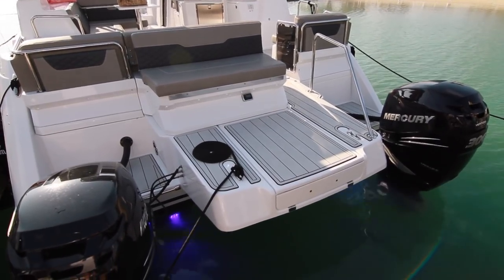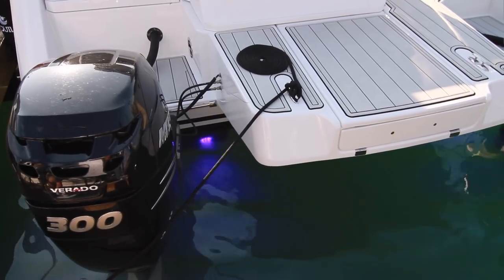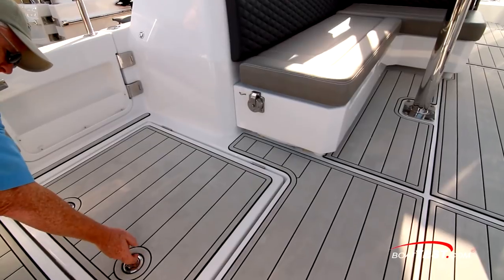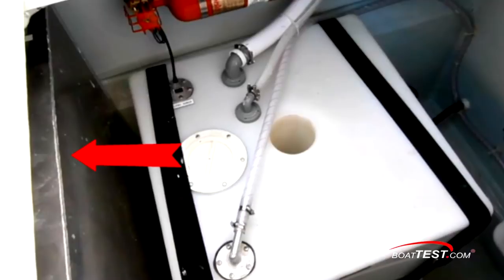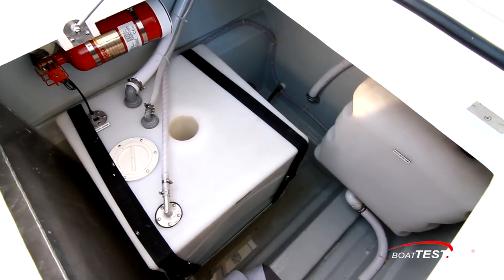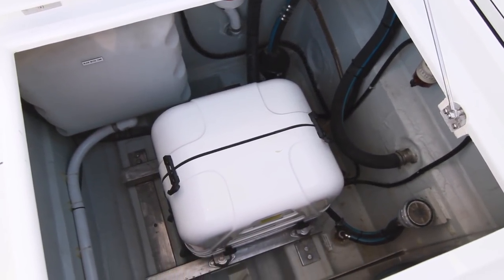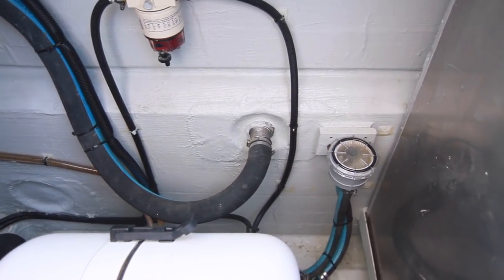The Aquila 36 is powered by a pair of Mercury 300 horsepower Verados, and notice how the engines are mounted at an angle to provide a bit more thrust to the torque and give the 36 a little more efficiency. Also at the boarding gate there's the connectivity for shore power. In the deck are two hatches, which starts to show the mirroring qualities typical of a catamaran. Inside are the independent aluminum fuel tanks feeding the independent propulsion systems, the white freshwater tank, and just ahead is the blackwater tank, all repeated to the hull on the opposite side, which also includes the Fisher Panda generator. We're seeing how Aquila is big on labeling, but big on systems access — two features that bode well for an owner-operated boat.